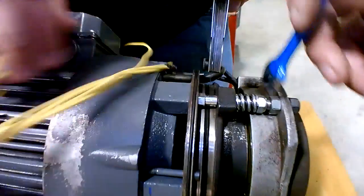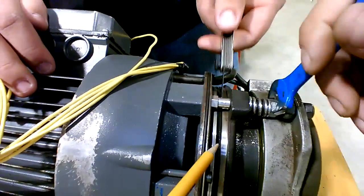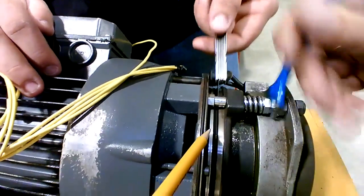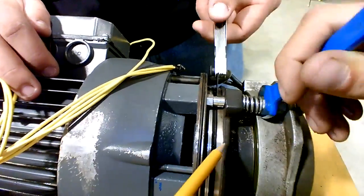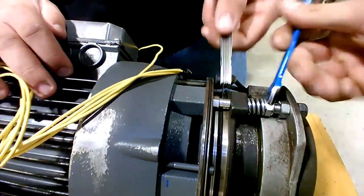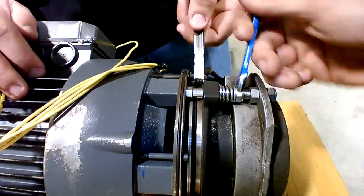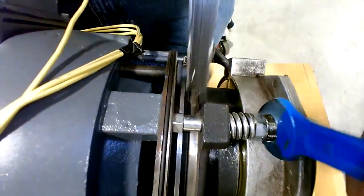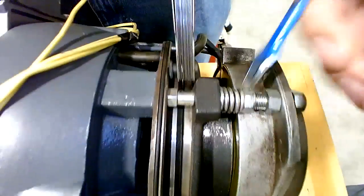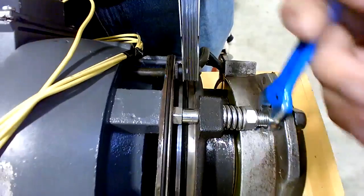If you look at where he's checking it, you've got a friction pad in there that has that sparkly color to it, it's like a semi-metallic. That's your friction pad, the black, and then you've got metal plates that it's going to come against when it engages. And the coil, that electric coil on the back, is what's going to pull to close that gap in. So he's continuing to check for a little bit of drag there with that 10 thousandths feeler gauge.